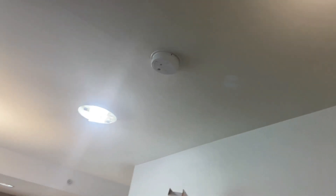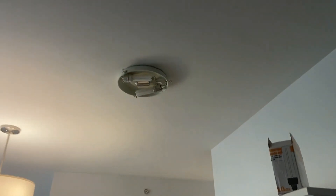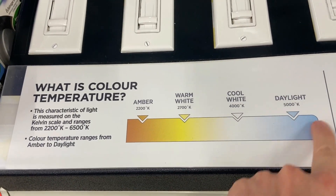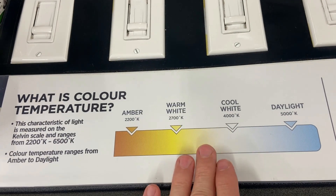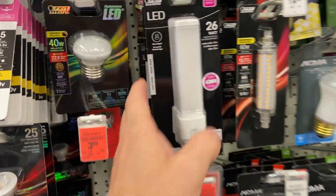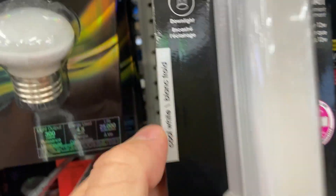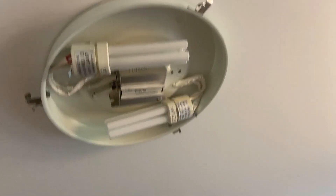Watch out for the color temperature of the light bulbs. The female in the house immediately said 'wrong color,' so there we go — redo. Besides finding the right base for the ballast, color temperature is just as important. Some extremes might be too objectionable or irritating for some people, so pick a color you actually like. Different products are available. I also found an LED replacement with this base that has four pins, offset index tabs, and promises to be cool white — the color temperature is indicated on it.